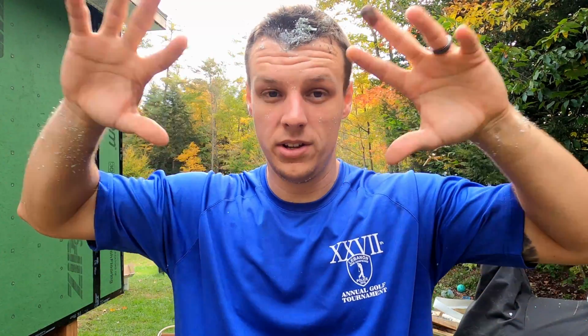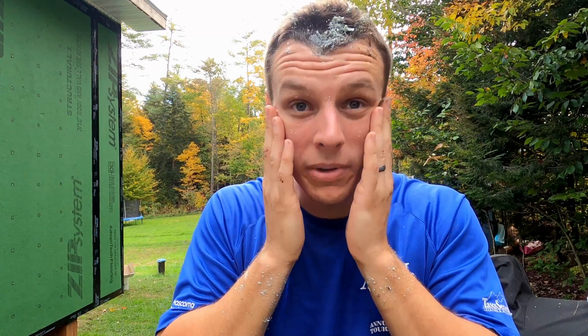What else? If you could get a hood to go around your goggles, because I got a little bit on my face. What else? The goggles. At first I was just spraying willy-nilly all under, letting some overspray hit the goggles, and at first it's not a big deal, but eventually it gets to a point where you can't see nearly anything, and I had to move my goggles at some points to see where I was going. So just make sure from the beginning you're trying to keep your goggles out of the way, because that stuff is not coming off. I tried a razor blade to scrape it off, but that stuff is on there.